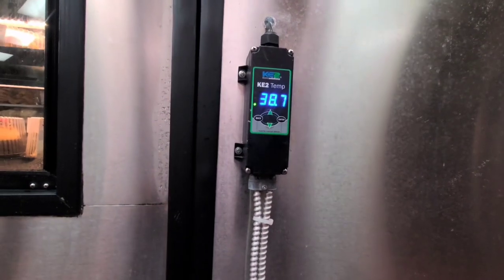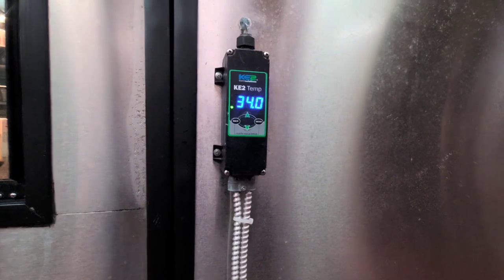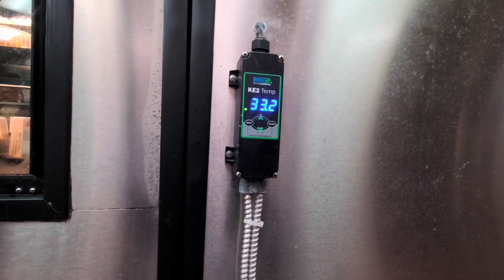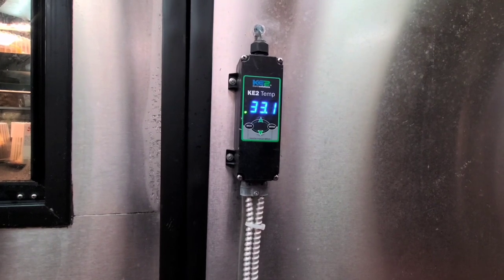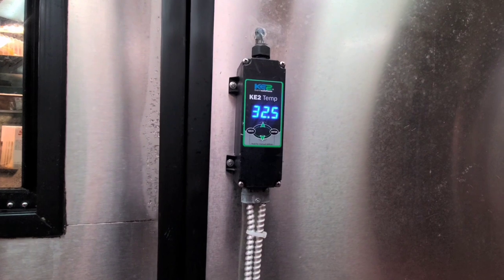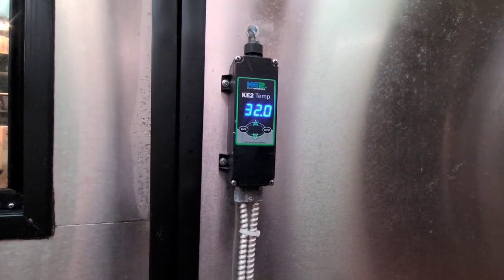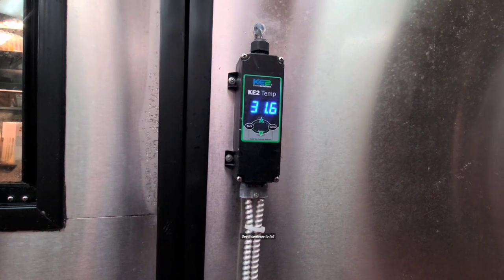And that's how they're regulating the case temperature in there, to keep it around 29 or 30, where they want the cakes, by using all these methods that they've implemented here. They've tweaked it just right to where that's how they get the case to stay where they want it to stay, instead of doing it the right way. And so the result is it freezes up to that big sheet of clear glass-looking ice that we came up on at the beginning of the video.